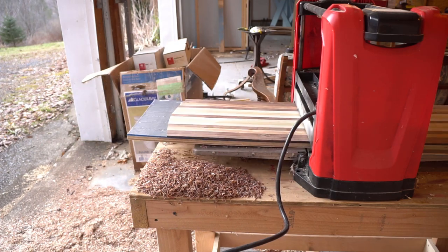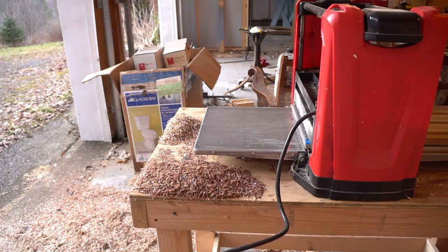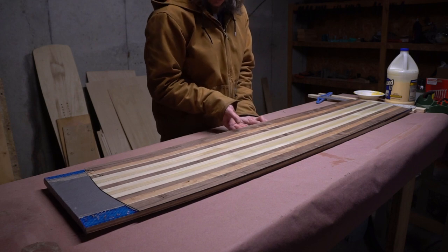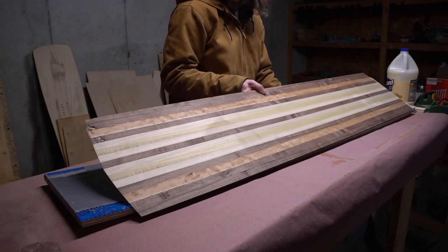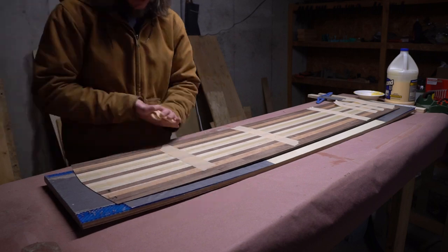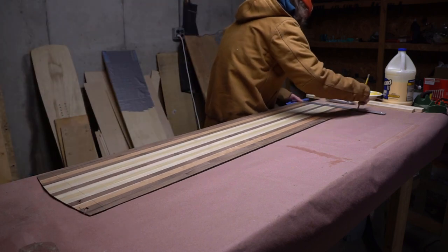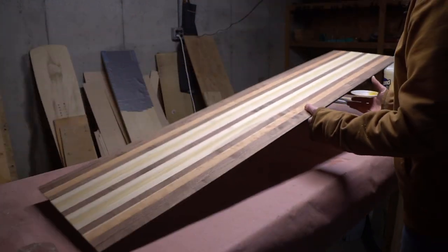I really recommend taking just the smallest bit of wood off with every pass. The core gets really fragile as it approaches the final dimensions. Once the nose and tail are tapered, you pop the core out of the cradle, and you're done! I squared up the ends of mine on the bandsaw, and in my opinion, that is one gorgeous snowboard core.